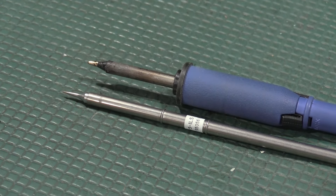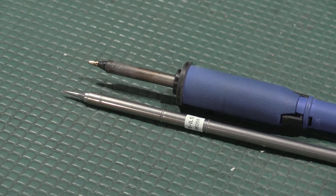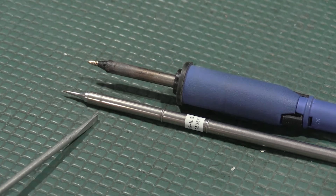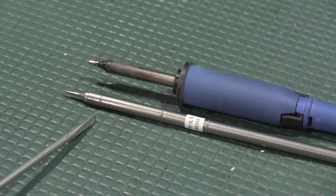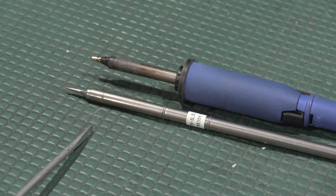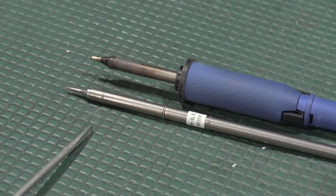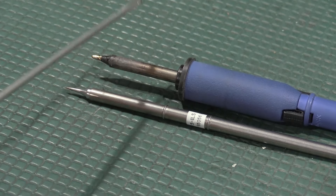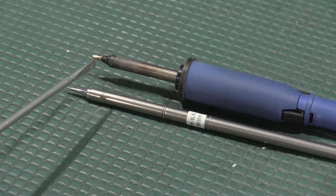The third way an iron is heated is with RF. I believe that's how the Metcals work, and Hakko has an RF iron too. The thing I don't like about RF irons is the temperature is set by the tip that you plug in. Where my base stations have a temperature set point I can tweak and change as needed, if I needed to goose the power on a Metcal unit I would need to change tips to a hotter tip. I'd need three different tips of this dimension where with the other system I have a single tip still running strong five years later.